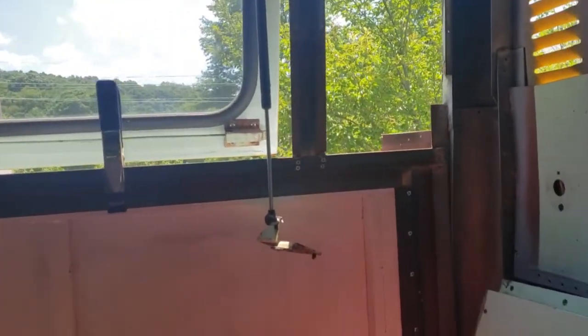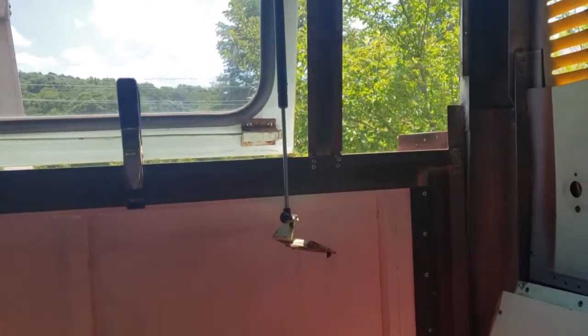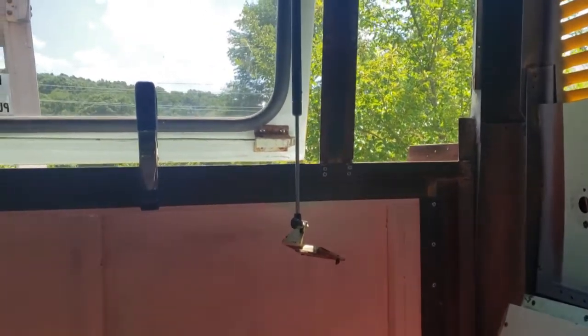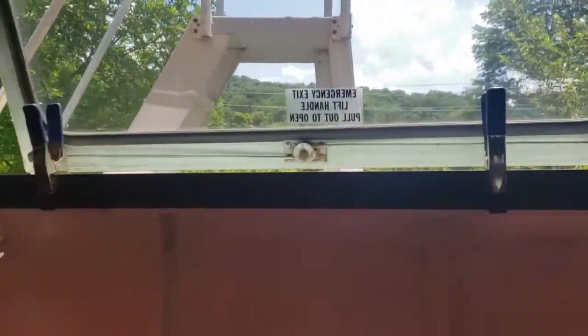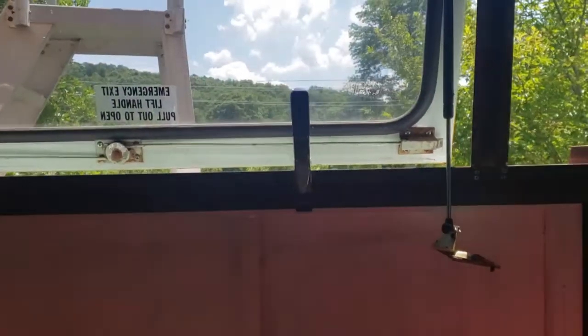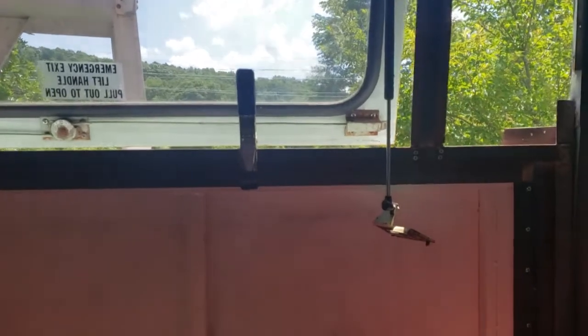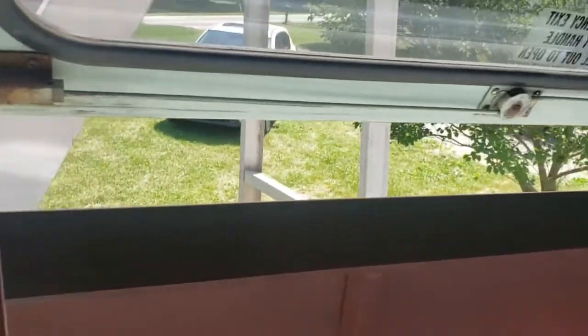So we're going to drill 5/16 holes, and then we'll use the other drill bit from outside to use the rivnut tool and insert some rivnuts into the frame of the hatch. So right now, before I drop the hatch, I'm going to drill those holes. Okay, so we have 4 holes drilled from inside.